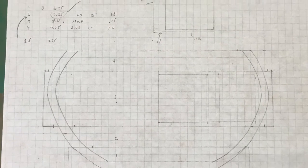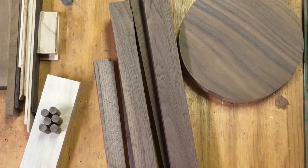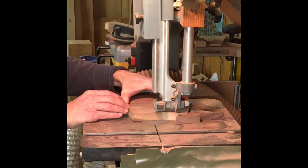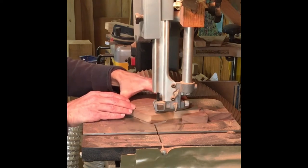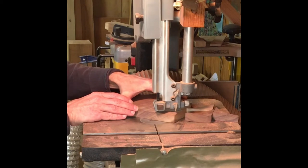We start out with a plan to determine your ring height, width, and diameter, and then you rip your boards. First thing I will do is cut out my base on the bandsaw, and I'll typically glue this onto a waste block and mount that onto the lathe and get that rounded out.